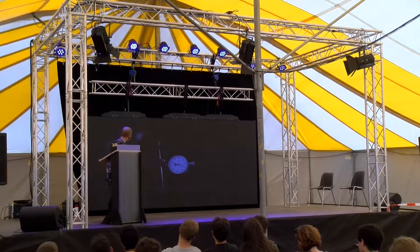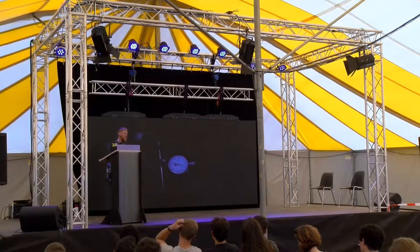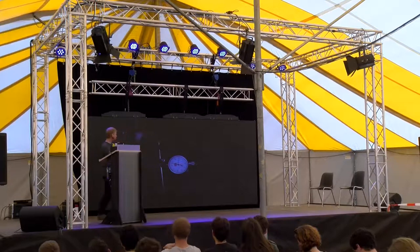What was I doing here? And then to test that it was actually concentric, because the engine and the gearbox were both bolted to a plate, a big face plate, and then I welded struts between the two. But before welding the struts between the two, I had to make sure that the two shafts were in alignment.